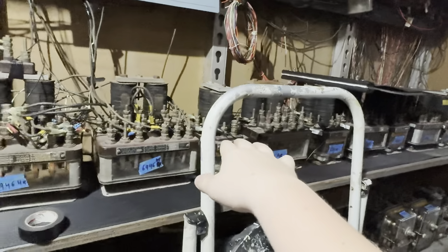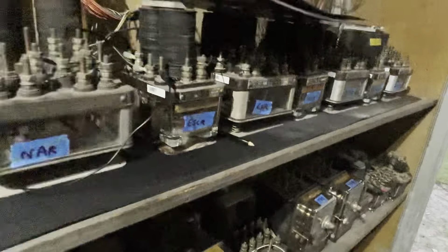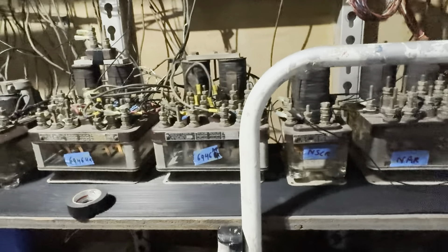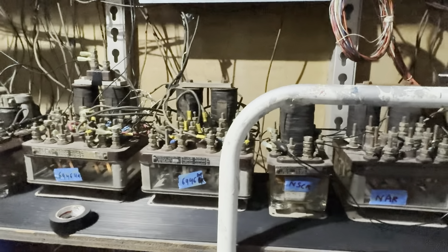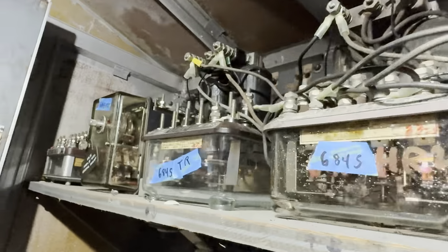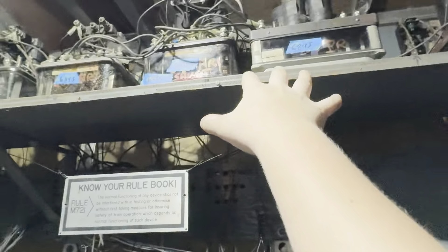Right here are all the interlocking relays — from here down and from this relay down — as well as these up here. They control the actual interlocking installed in this bungalow. Here we have the home and distant relays for all the signals outside. There are many timer circuits added on that make a lot more happen than just what these two relays control — you can see they're both pretty full, and there are repeaters of those relays down here. This is all configured as an automatic block signal setup: this is one signal, this is one signal down from that, and so on.